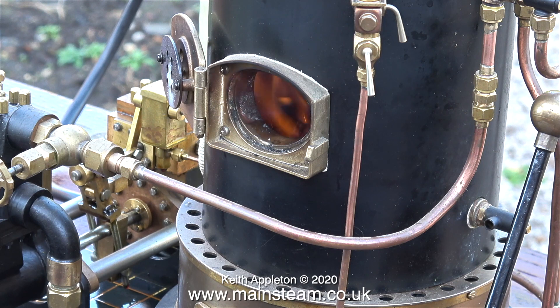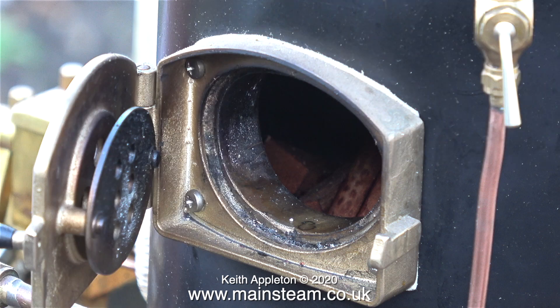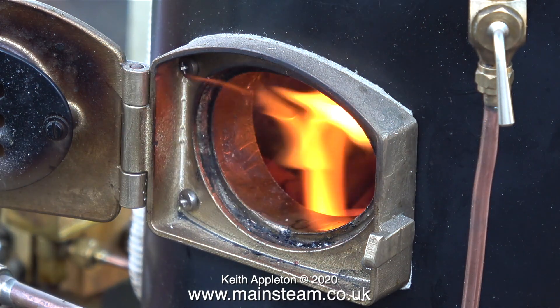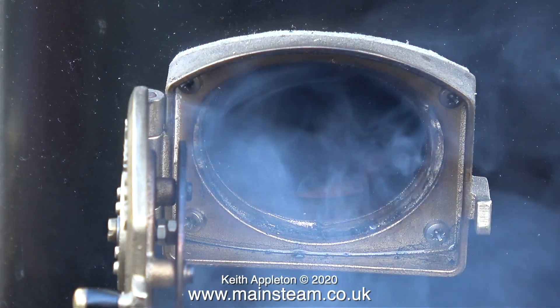I put the mahogany in the fire hole door and lit it — looking good, a nice fire in there for about 30 seconds, and then no fire at all. I'd been using the cellulose thinners to clean some paint off the blowdown valves for the Simplex Prairie Tank, and just thought it was a good way of getting rid of the dirty thinners. But no, it doesn't work, particularly with mahogany. I find that the best stuff for lighting fires in steam boilers is charcoal soaked in white spirit or paraffin. With mahogany soaked in white spirit poured through the fire hole door, when I light it initially it seems to burn well, but very soon the fire's looking a bit sick. I'm not using an electric blower on this boiler — I'm using natural draft — and when the wind blows it puts the fire out.